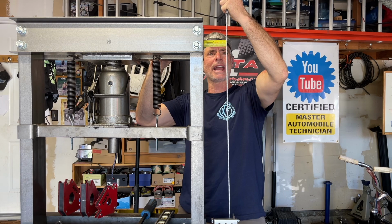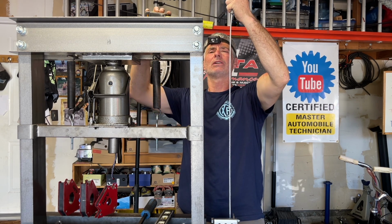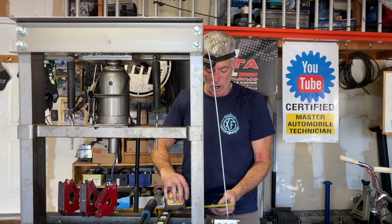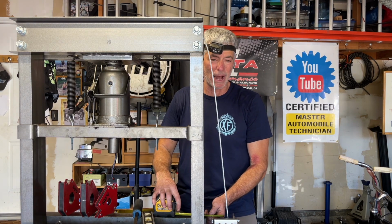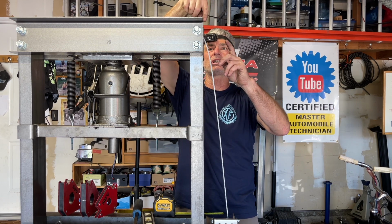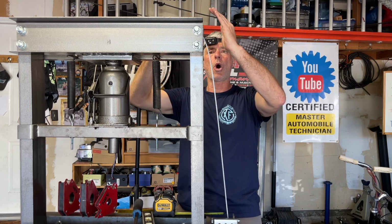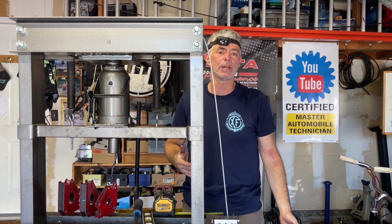So it looks like if I have the pulley out about 3 inches from the edge of this, that would be perfect. But maybe what I'll do is I'll measure to the center of the drum, to the I-beam, and use that measurement. Yep, that's about 3 inches. So if I have the edge of the pulley 3 inches out from this I-beam, then the cable will get a nice straight pull over the pulley towards the other side. So that's what I'm going to go for.